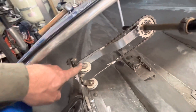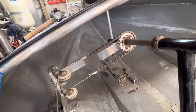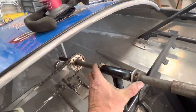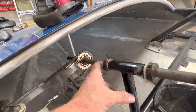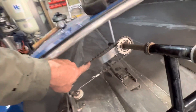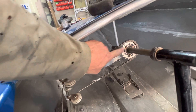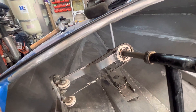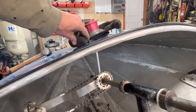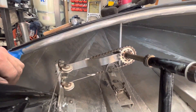This bracket just bolted right in from the 146. I just made this little brace right here because normally you'd have some sort of a brace coming down from the bow to help anchor the end of the steering shaft so it's not moving anywhere. If you get a little bit of slop in your bushings, then your whole steering shaft gets messy. There's a bushing in it as well. You want these steering cables like piano wire tight. So as these are pulling this way, this little brace is helping prevent any side load on that steering shaft. They usually get braced from above, but this is all just thin aluminum up here — not a lot of strength in that. It also keeps things clear; my foot already clears the chain.